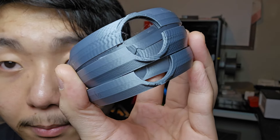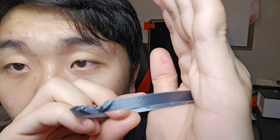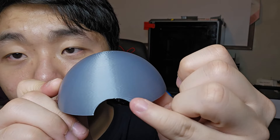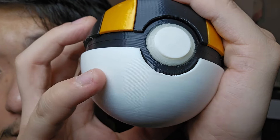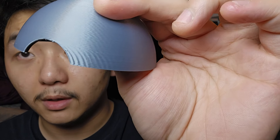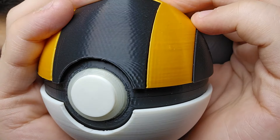One side prints flawlessly but the other side still prints badly. I did another test print but it failed because the bed is really inconsistent — you can't get three or four consistent prints without cleaning the bed each time. The ringing is showing less and less but it's still there. On the top of the pokeball you can see ringing after ringing on one piece, but on the recalibrated piece there are only tiny ringing lines — so much better. On the black piece it's minimal.